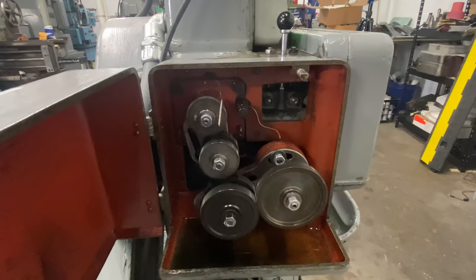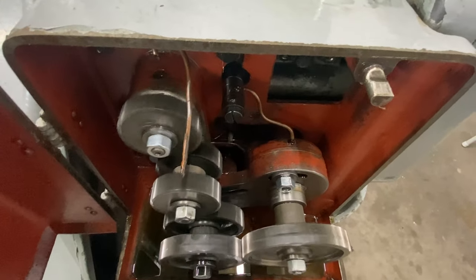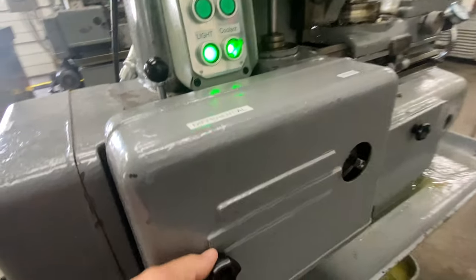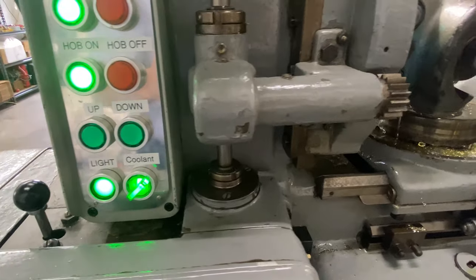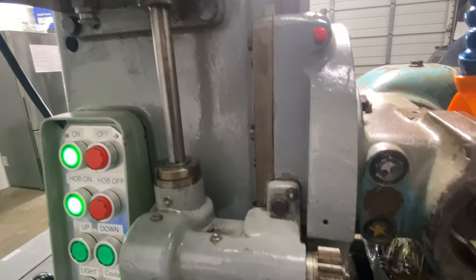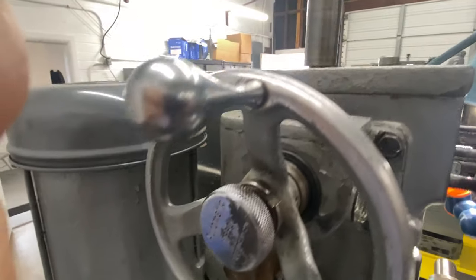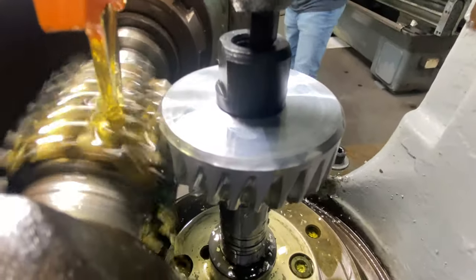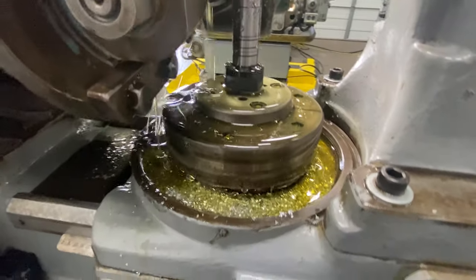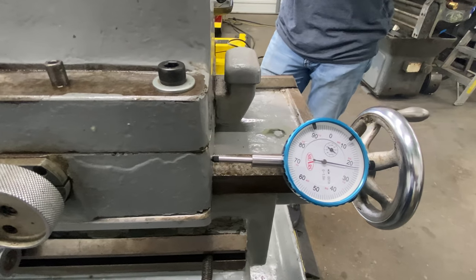Here is the index gearbox — use it to set the tooth count for the gear you're going to make. It runs full of spur gears. The next box has two clusters: the differential on the left and feed gears on the right. A little black knob is there to engage the differential. There's the stem that goes up to run the feed mechanism and move the hob head up and down for climb or conventional hobbing. There's the hob cutting a helical gear as we speak. Underneath the platter is a big worm gear, and here's the dial indicator for measuring the depth of tooth cut — the working depth for your tooth.